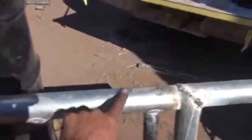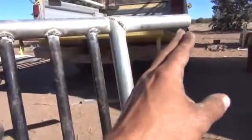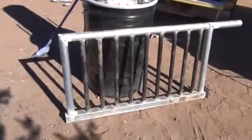The smoke will be forced down through all those one inch pipes — there are nine of those cut inside of there. Over here, what I've done is basically cap that end off right there, so this upper pipe stops right here. All the gas has to come through that upper pipe and go down to the bottom square pipe, back over to this two inch piece, back up that two inch and over into our other bed rail. So we're basically forcing the smoke to come uphill across and then forcing it downhill across all these radiator bars into our square stock below, up the final two inch out into the other side of our bed rail radiator system. I'm going to make my cuts, get my angles right, and weld that into place.